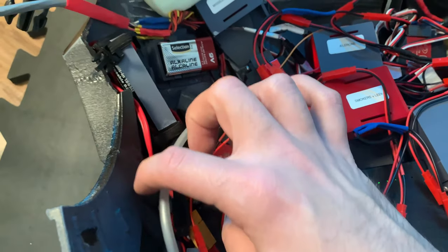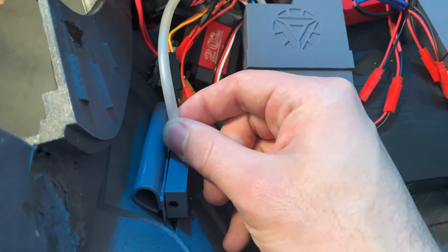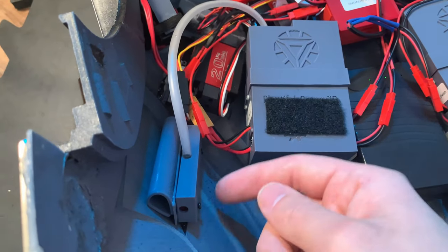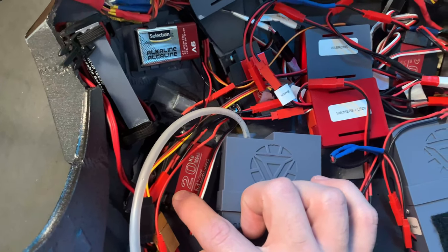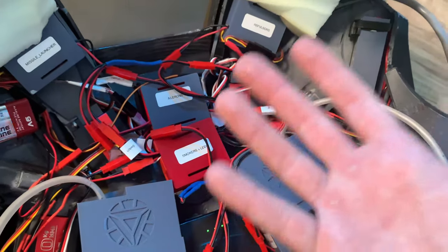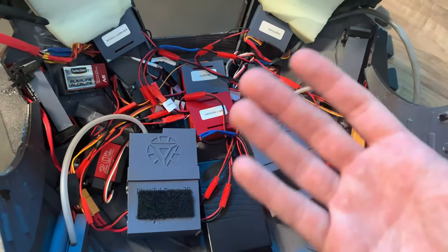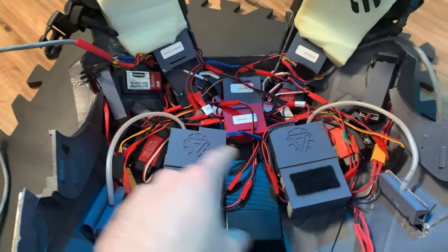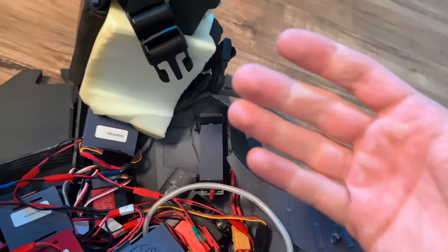Next up we have this aquarium tube which snakes all the way back here to a mount I designed in Tinkercad. Not only does this hold the tube in place but it also holds all the LEDs you see outside. And behind this whole mess of wires you can see there are four 20-kilogram torque servos in each corner which control all four ailerons. I already have a tutorial on my channel explaining how you can build your own back flaps on an Iron Man suit. Most of these wires and Arduinos will make their way to either of these two wires that go down my arms — one for the missile launcher and the NeoPixel in my hand, and the other for the switch for the ailerons and also the NeoPixel and the laser in my arm.